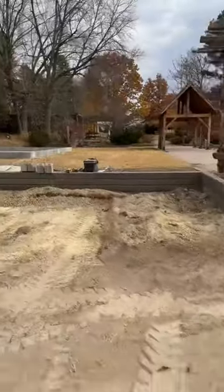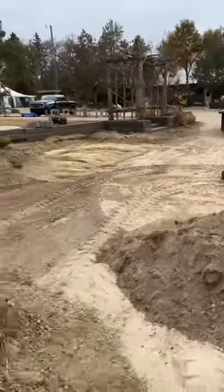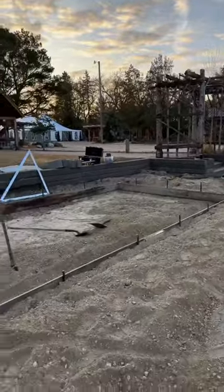The area had previously been excavated, so there was a good granular fill all the way underneath it. Just scratched back the crushed rock. Used 1 by 8 to do the forming of the overall pad. That's going to be 10 feet by 22 feet.